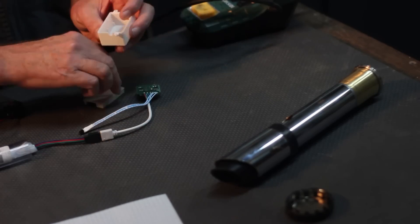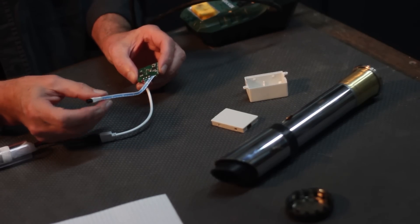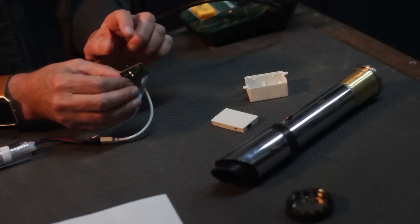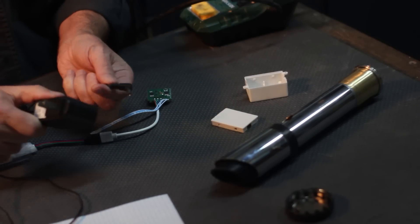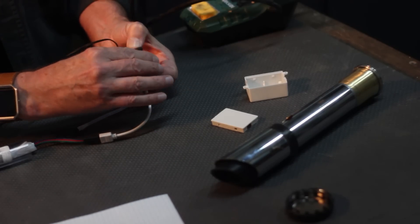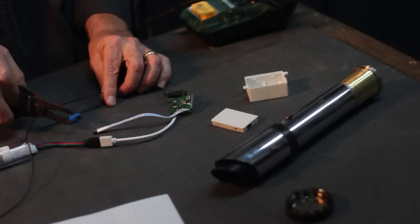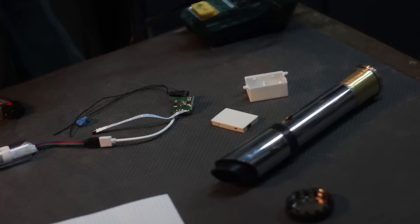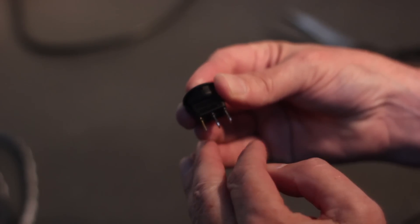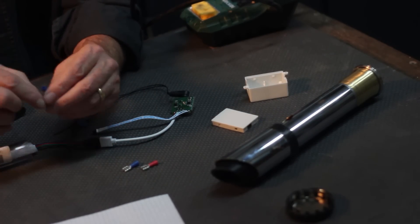For the electronics, I'm taking the small circuit board out of its plastic case — it's got a sensor on it for the remote and its connection. The back has a plug made for a 12-volt adapter; I found one in my drawer that worked, so it'll be the sacrificial plug. I'll trim that out and mark which side is positive and which is negative. On the on/off switch, there's a copper plug for the ground, a middle, and then the on/off on the end. You could use automotive clips and just crimp the wiring down without soldering.